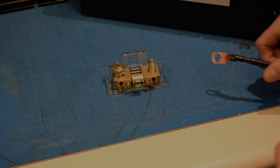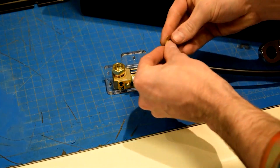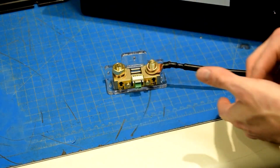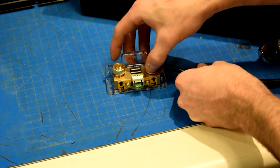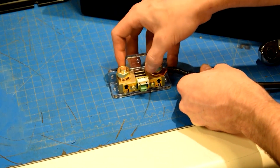To begin, connect the black wire to the shunt using the ring terminal as shown. The negative terminal of the battery must connect directly to the B- side of the shunt. This will be the only connection to the negative battery terminal. Tighten the bolts to the appropriate torque.